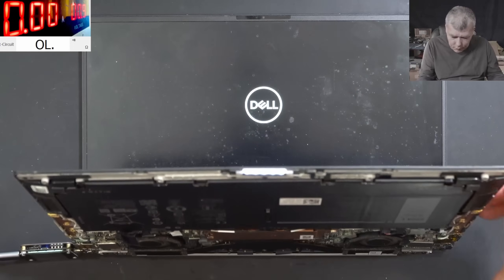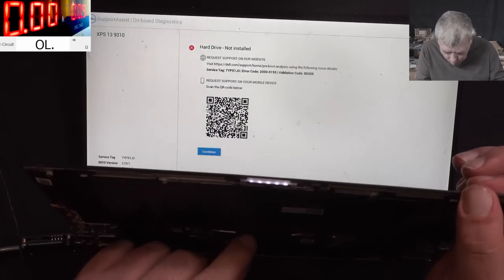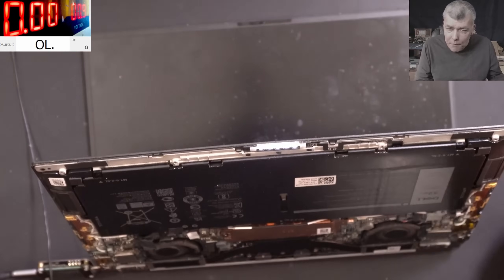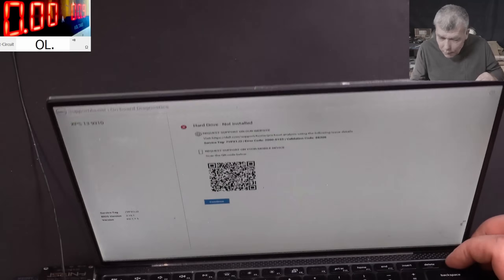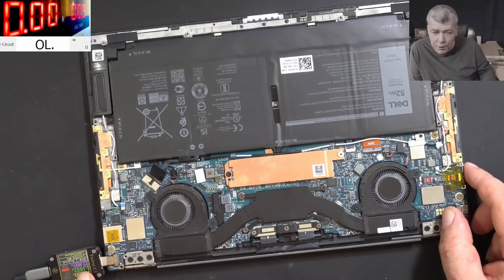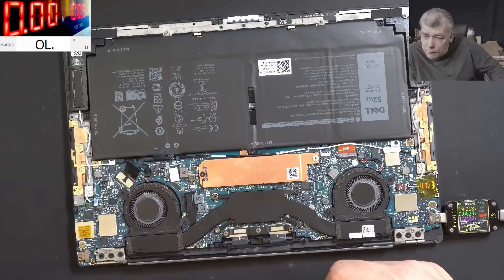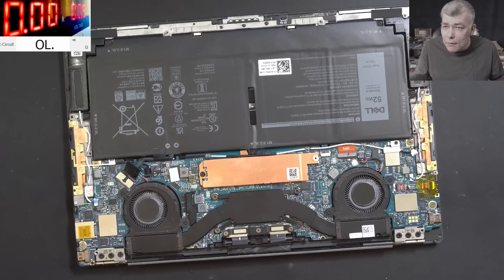Let's wait and see if it's loading Windows. Hard drive not installed — they took out the hard drive. But that's not our problem. On this port it's charging with 1.1 amps, and here it will charge with the same amount of current — 19 volts, 1.1 amps. So I believe this is fixed. We can call this a repair.